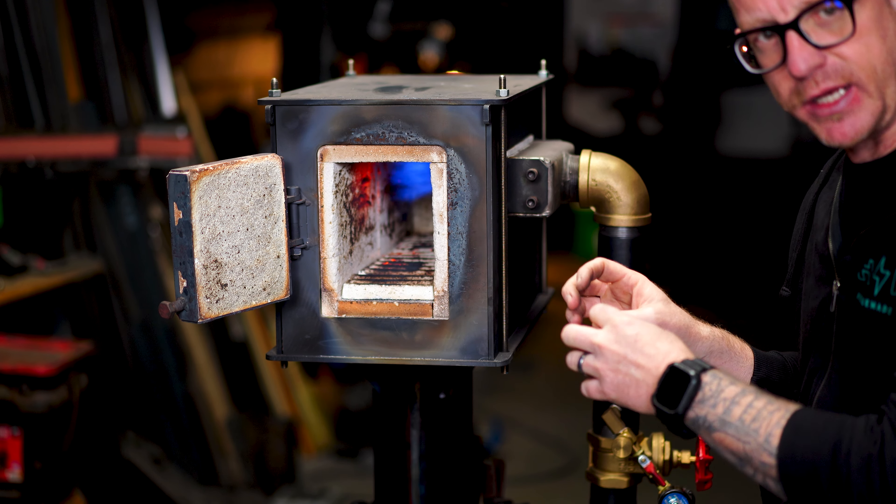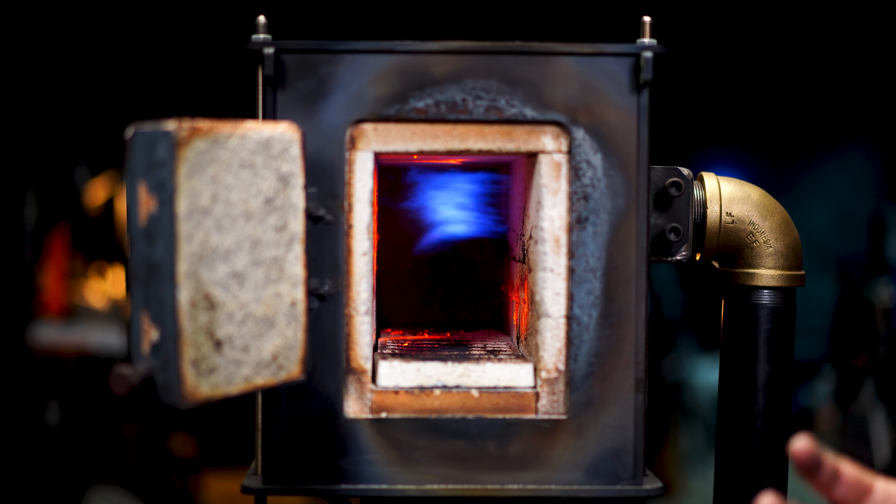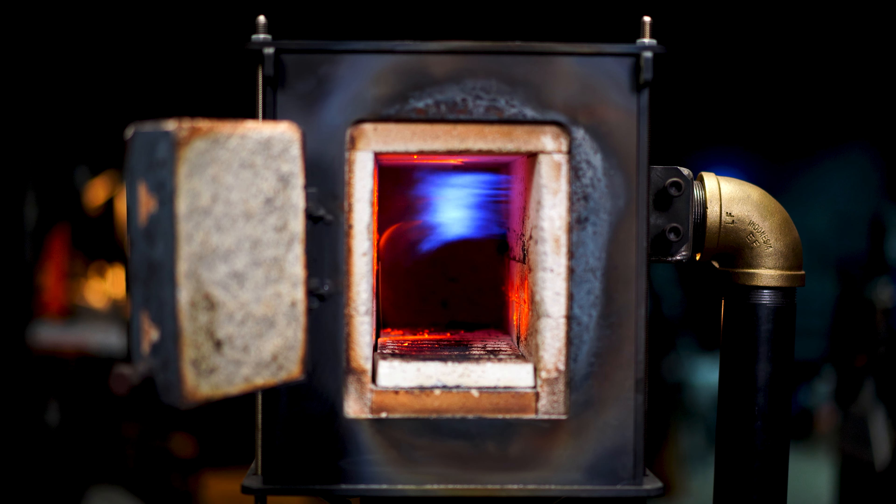Looking closer, you can see the flame looks pretty good but it is disrupted. I'm running at about 2 PSI. I'm not going to touch the regulator anymore — instead, I'm going to turn down the air slightly using the gate valve. I like the gate valve because you can really fine-tune it. With your ears you can hear it becoming more stable. The flames are not jumping as much. Now I'm going to dial back the needle valve slightly — just about a quarter turn.